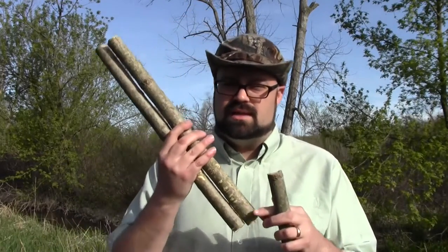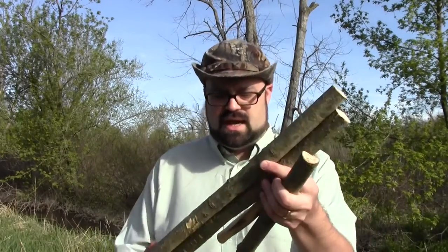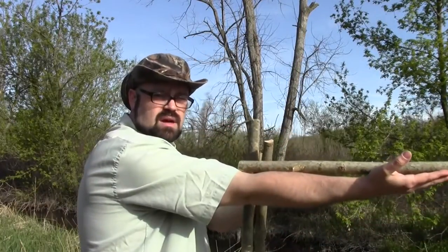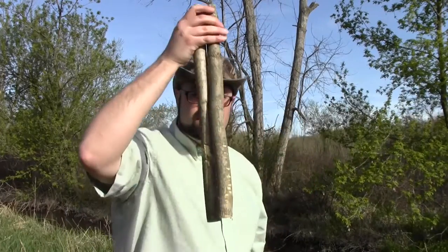With a buck saw, the length of your handles determines how big a piece of wood you can cut through. In terms of size — from my fingertips it's almost coming to my mid-elbow — that's for the handles; you need two of those. I got all of my pieces from the same piece of tree. It was a standing tree whose top had been knocked down, so I just processed it up.